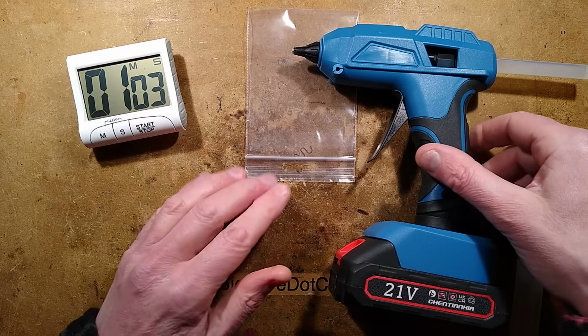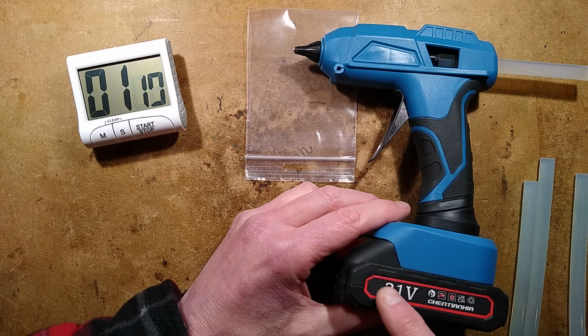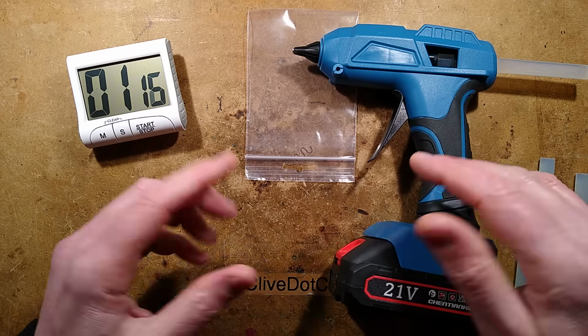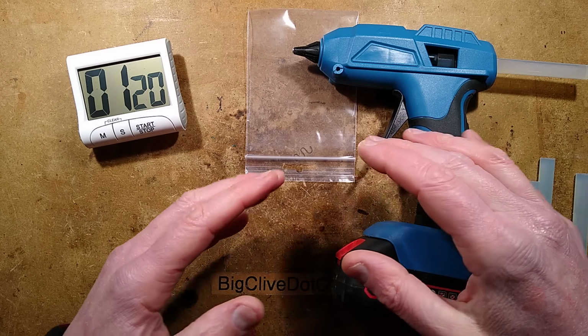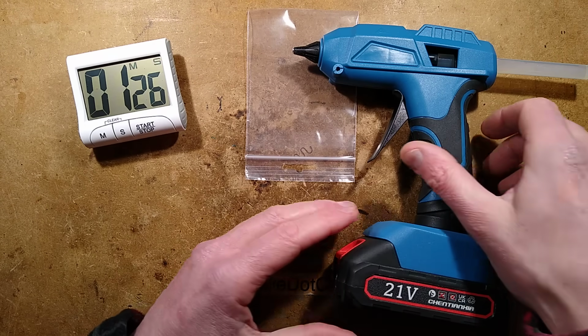And something I did not know, the real Makita batteries, I looked at people swapping the cells in them, and the real Makita batteries do not individually monitor cells. They just monitor the end of the battery pack of 5 cells and then one in the middle, and they don't individually monitor. So there is no actual proper protection against over discharge and charge.